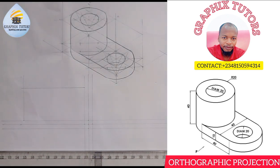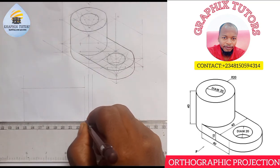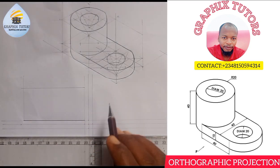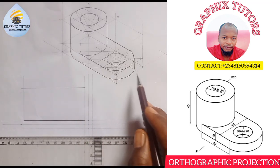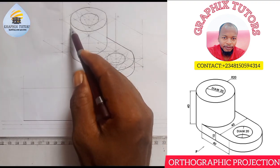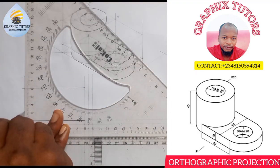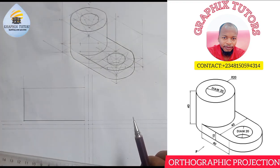I can project it upward this way. Now we're given a thickness of 10. First I'll take it from the beginning straight down to the end. Why? Because you're looking at a curve — looking perpendicularly at the curve, you see it as a straight line. That is why I'm drawing a straight line from the beginning to here. When you add thickness, the height also appears as a straight line.